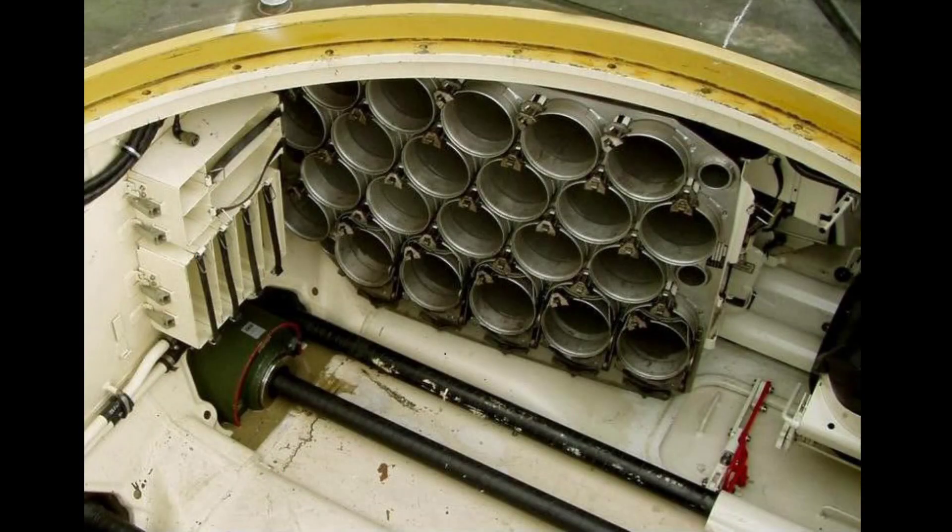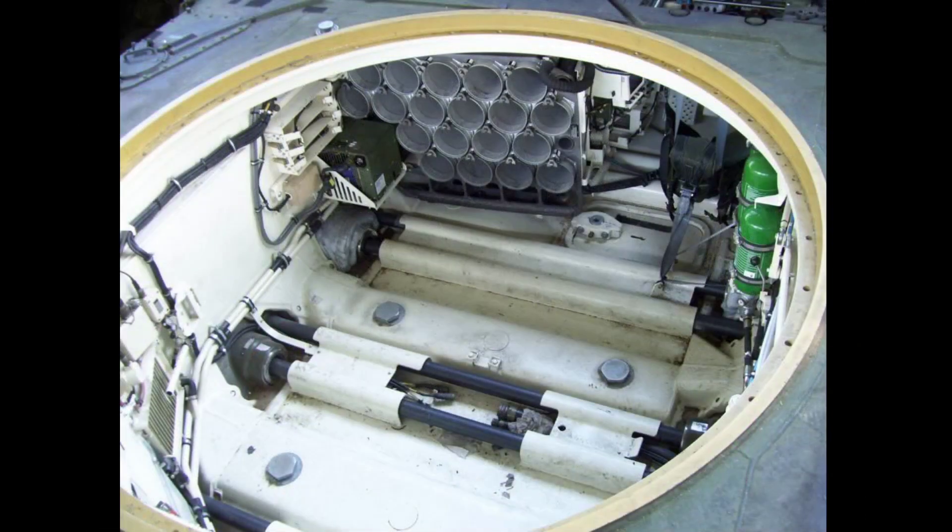Here you can see how the ammunition rack in the hull looks like from the crew perspective inside the tank. The only upgrade for the Leopard 2 series hull ammunition rack was to reduce the amount of ammunition stored in it, thus creating an air gap between the ammo rack and the hull belly. This was made for increased protection against underbelly blasts from IEDs and anti-tank mines. You can see that the ammunition amount in the hull rack was reduced, and there is an air gap created between the hull belly and the ammo rack itself.